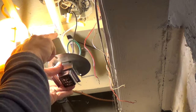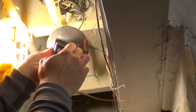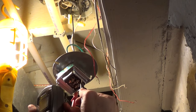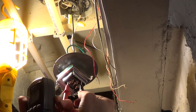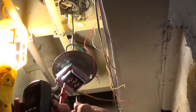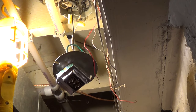I went ahead and wired up the correct wiring — white to white, black to black — and then grounded the ground to the plate. I want to first test out these voltages. I got a multimeter set on automatic, and let's see: these two leads should give me 16 volts, and I'm getting 18.5, which is fine — that's about 16. These two should give at least 8 and they're giving 9.6, and these two should be close to 24 and they're giving me 28. So it is working and it's all generally within the range I need. I'm going to reattach the plate, turn off the power, and then go from there.